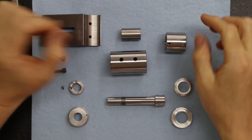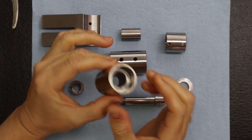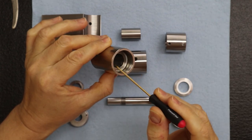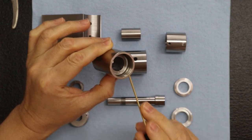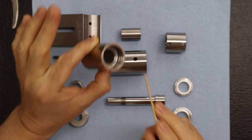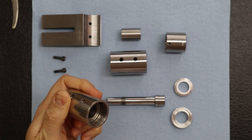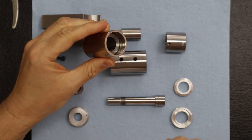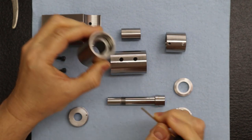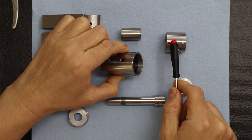We mentioned to you when we were disassembling this spindle that in the spindle housing, there's that external bearing ring spacer. Very precision. We told you it's a press fit, and you really don't want to remove it until you've done an initial cleaning and then made a determination if it needs to be pressed out, because you don't want to press it out just to do it. Only if it's really needed, especially if there's a lot of grime or even corrosion rust. In the last scene, you saw that this was still in here.